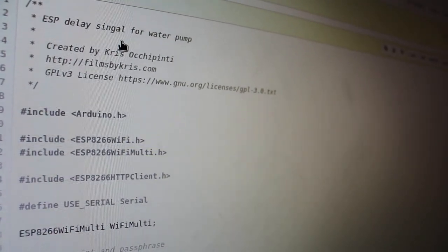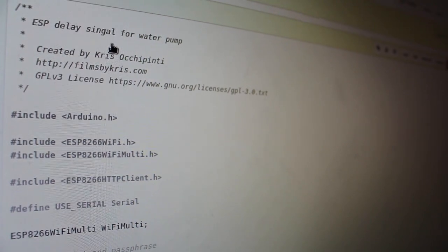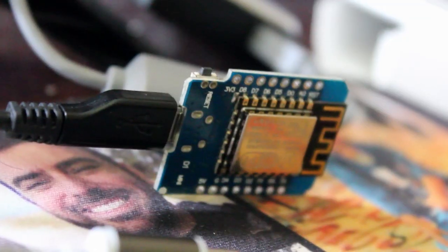You can also go to my GitLab page at gitlab.com/metalx1000, search for the project called 'hardware', open the folder called 'esp8266', then the folder called 'water switch' — there's a single file in there. You just need to put in your access point SSID, its passphrase, and the URLs you want to link to. After modifying the code, hook up your USB, compile and upload, and you're good to go. I've covered setting up the Arduino IDE with ESP8266 in previous videos.